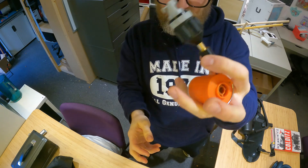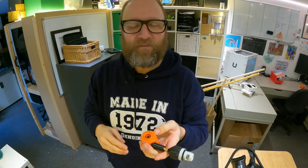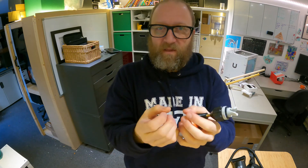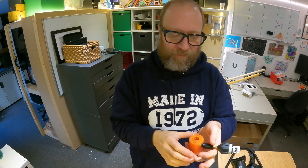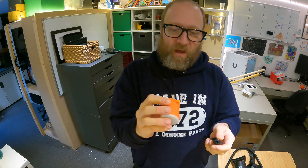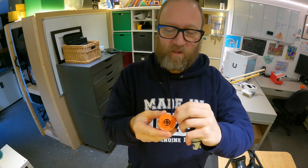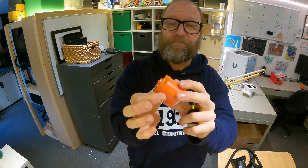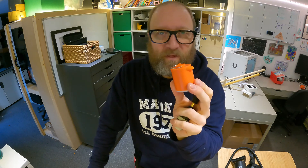What I found is tire pumps are all about pressure. It turns out there's not much air in a tire — whether it's a car tire or a bike tire — but you need that air to be under high pressure. A tire pump doesn't really pump out lots of air; it pumps out pressure. These pumps move air but they're rubbish with pressure. When you actually find a little spec sheet, you find out this will pump around 190 litres per hour, but the pressure is something like 0.65 PSI.